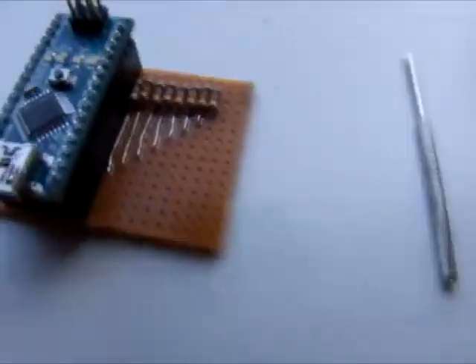Each one of those is connected — one wire goes to the five-volt supply, the other wire goes to the control panel and solders into the connection holes. See the video on how to do this. Mine all comes back to my controller, which is mounted under my baseboard.